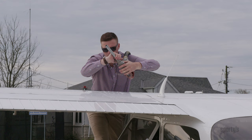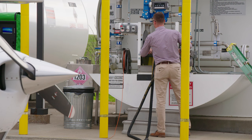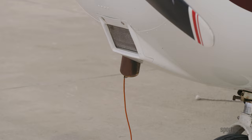Fuel your aircraft with caution as you don't want to overfill and dump it all over your wings. This can create quite the mess and ruin your clothes. After the tank is fueled, immediately replace the cap. Turn off the pump with the switch or lever and retract the fuel hose when finished. Typically there will be a retract button that uses an electric motor to wind the hose back into its reel. Keep it under control though, as sometimes these move pretty quickly.